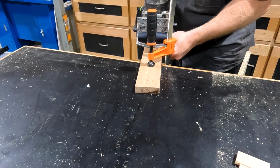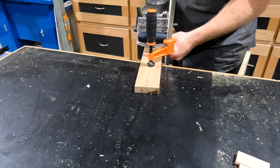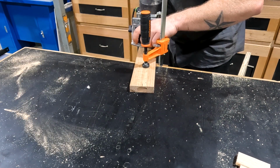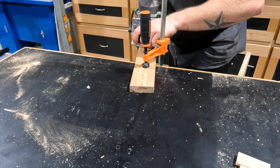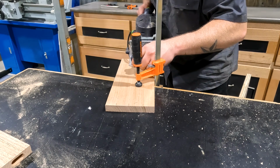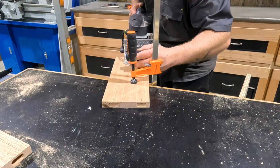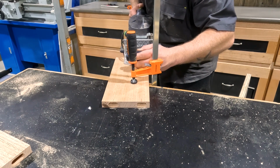Now what is a domino joiner? A domino is pretty similar to a biscuit joiner, which you may be familiar with. Instead of cutting a thin slot for an oval-shaped biscuit, the domino joiner cuts a mortise that can accommodate a thick tenon. To do that, it uses a spinning bit that is similar to a drill bit. The trick here is that it moves not only up and down, but also sideways. This allows it to cut a full mortise in a single plunge.